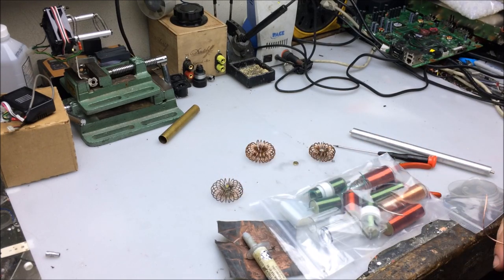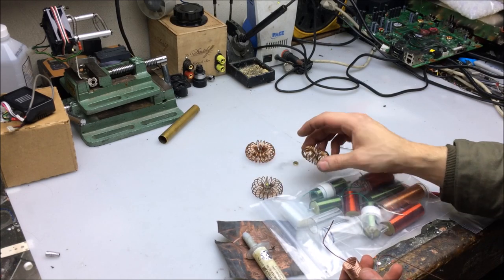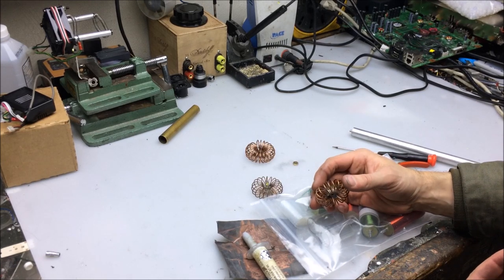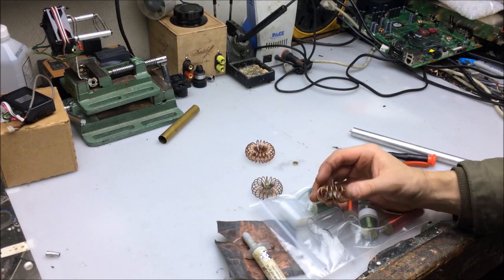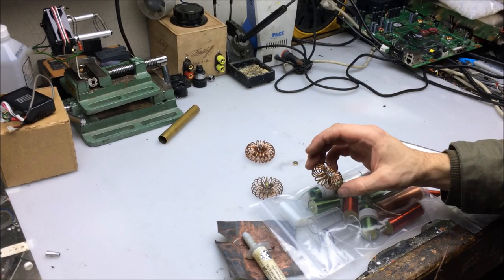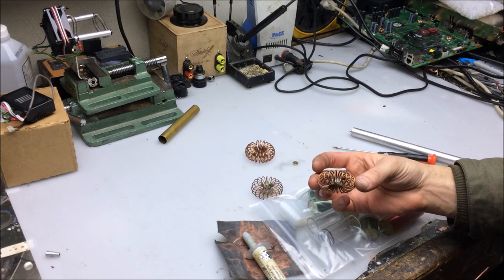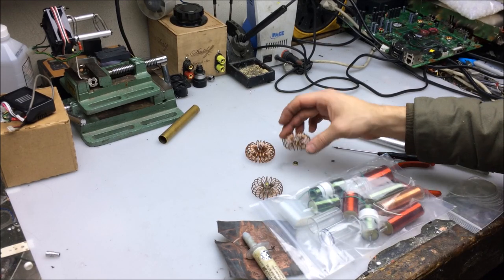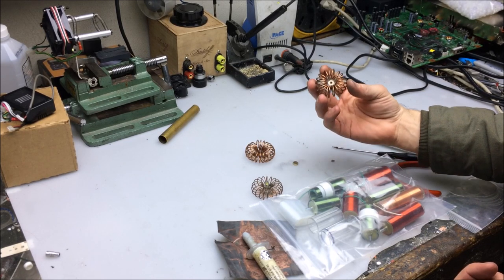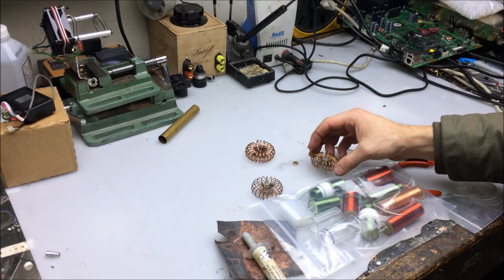The same thing occurs with direct current. If you're having a DC potential on this, it'll act more like a piece of wire at lower voltages than at higher voltages. So it's kind of like what you're saying: at higher frequencies, that AC couples with the air and acts larger than it is — the capacitance acts larger than it is. Not just with the air alone, but through the air it AC couples with other surrounding objects. And because the air is a dielectric, effectively it has a k-factor of 1 as our constant here on Earth. That allows an electric charge to build up on this device without leaking or receiving any electrons. This is basically one terminal of a two-terminal capacitor, and the second terminal is everything else in the room, including yourself.